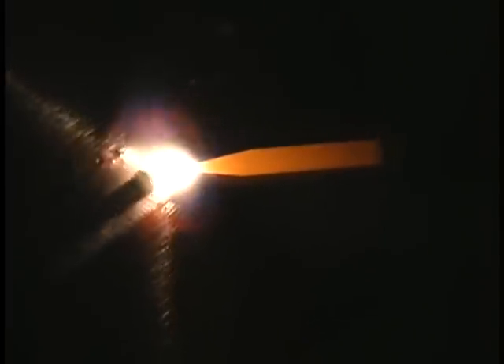Here's a butt joint — same metal, with a small chamfer and a gap. You can see I'm doing pretty much the exact same thing: moving ahead with a tight arc, then pulling it back while I add rod. It's almost the exact same technique for both lap joints and butt joints. Things look a little different though — on the butt joint you need to watch the puddle every time you pull the rod out, making sure it's going all the way into those sharp corners in the root to ensure penetration. But the motion is roughly the same: straight forward and back.